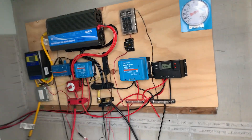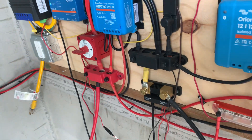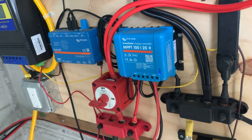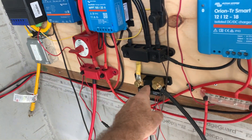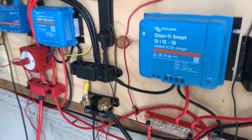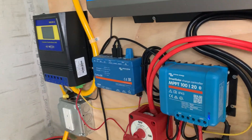Those are your main components — that's how it's all being used. With the inverter and the lithium, I put in this kill switch just to be sure — it's a marine on/off. And this is the Cerbo GX which lets me monitor everything going on in this room. As you saw, that's not Bluetooth, that's on the internet. This communicates with the internet and gives me data from the solar controller, the shunt, and shows me even the starter battery now which is being charged by this panel. These wires that look a bit unsightly are just communication cables or power cables for the communication device — not critical.